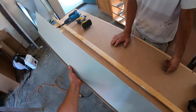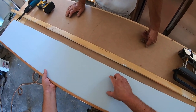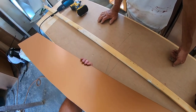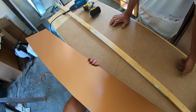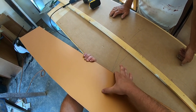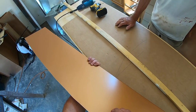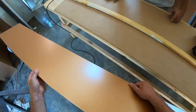All right, so that's it. We have a nice tight 3/4 inch hem, and then we're going to bend the panel wherever we need to get the flashing to line up correctly. This one is gonna go on the top, so we are going to bend it here at about 5 inches, at about maybe a 25 degree angle or something like that.